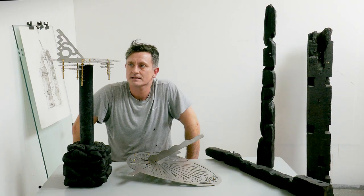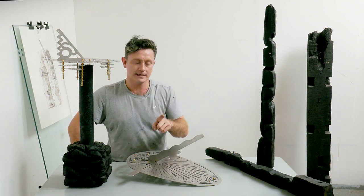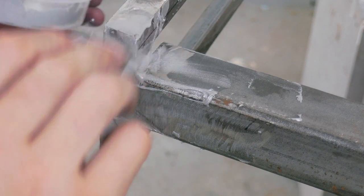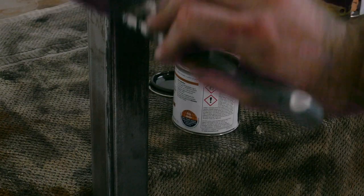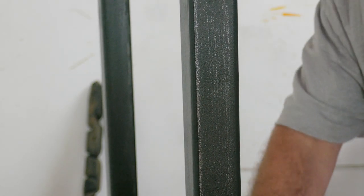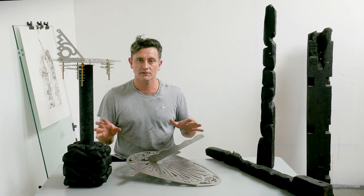We're basically done in the studio. The next step is to take everything outside and make the bases. Speaking of which, the vertical sundial base has just been finished — it's been painted black. Before that I had to sand down and fill all the rough edges from my welding using a two-part metal filler, then apply it, sand it down, paint all the metalwork with a brush, and then roll-finish it for a smooth coat. I'll probably give it one more coat outside to make sure it's weatherproof, and then we can install the final works.